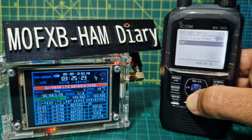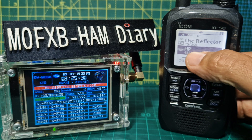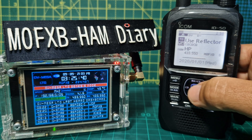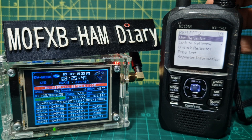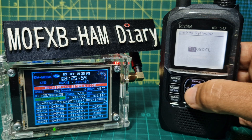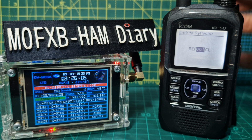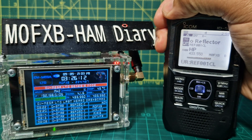In DR mode, select the entry with the B suffix I just created. Go up to the top where it says the two up-and-down options — you'll see it highlighting. Go to Use, press Enter. If you want to link, select Reflector, press Enter, go to Link to Reflector. If you want direct input press Enter, and you can select reflectors: XRF, DCS, and XLX. Go to Reflector, select one not already on this radio — go to 001 and across to CL, press Enter. Now if I key, my hotspot will try to link.